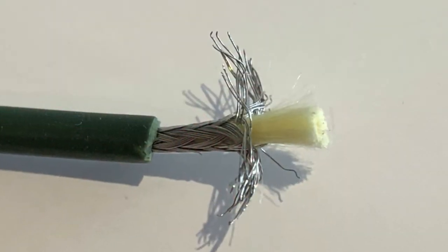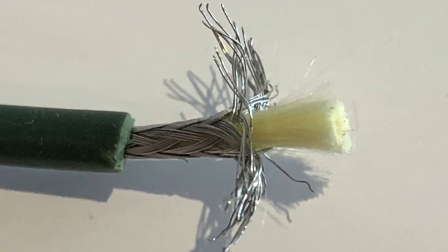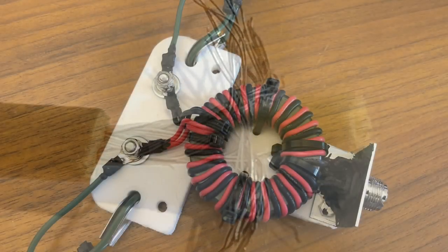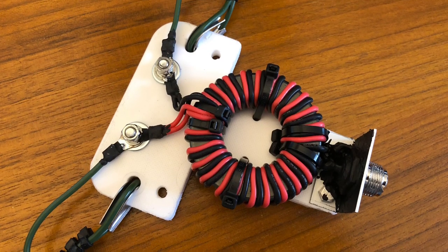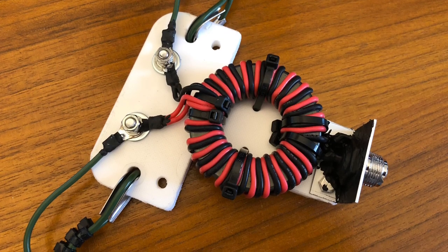And the wire I'm using is a DX Commander DX50, which is a Kevlar cord copper stranded wire. And to keep the moisture out, the connections have all had liberal coating of liquid rubber, and the PL259 will eventually be sealed with self-amalgamating tape and electrician's tape.